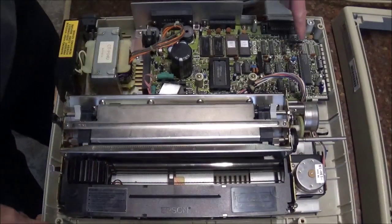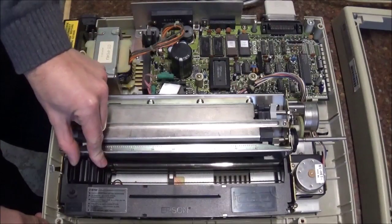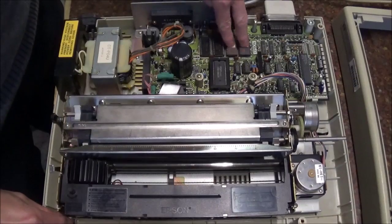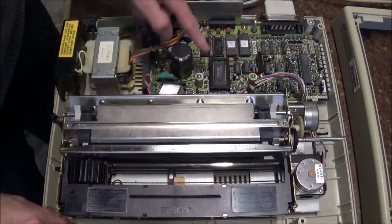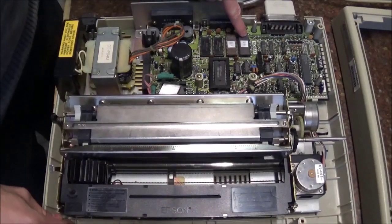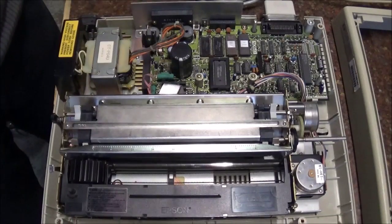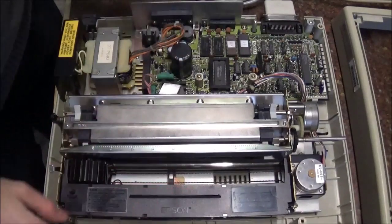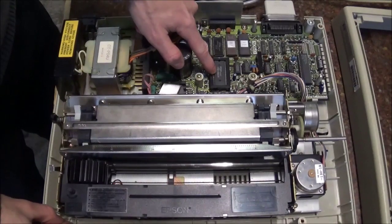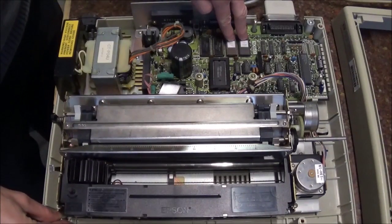This slave CPU takes care of all of the head movements of the printer, moving the print head back and forth using what they refer to as the carriage step motor. These two chips up here are the ROM chips, which hold the program for the printer. Interestingly, with this CPU and some configurations, one of these ROM chips could actually be removed, because this CPU has some internal ROM that could be loaded with the print program if so required. If the CPU was a 7810, then that CPU would not have any internal ROM, so the external ROM would be used in its entirety.